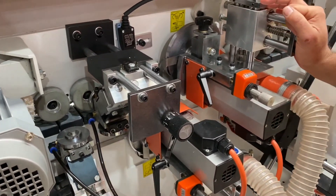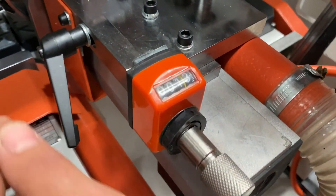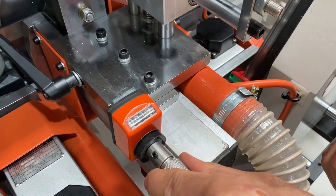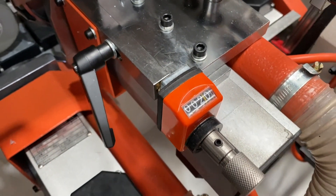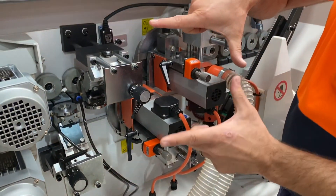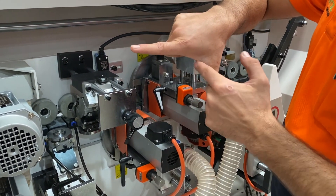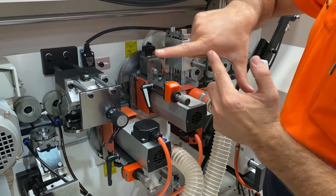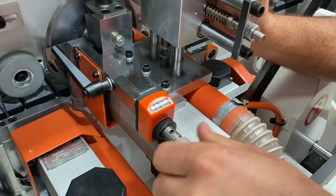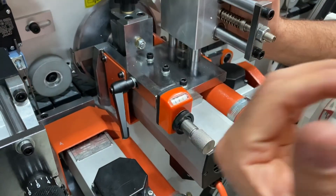Changing for different thickness edge tapes: if you're going from 1mm to 2mm, currently we've got it set for 1mm — about 1.3mm to give a slight radius. Loosen off this knob and you can adjust that up; for 2mm, go to 2mm edge tape and then lock it off. Do the same on the bottom — loosen and adjust. Basically the cutter is shaped to cut top and bottom; pushing the cutter in cuts more on the radius for 2mm, and pulling it back works more for 1mm. When going back down, go past your size and then come back up to it — that gives you a more positive, accurate reading.